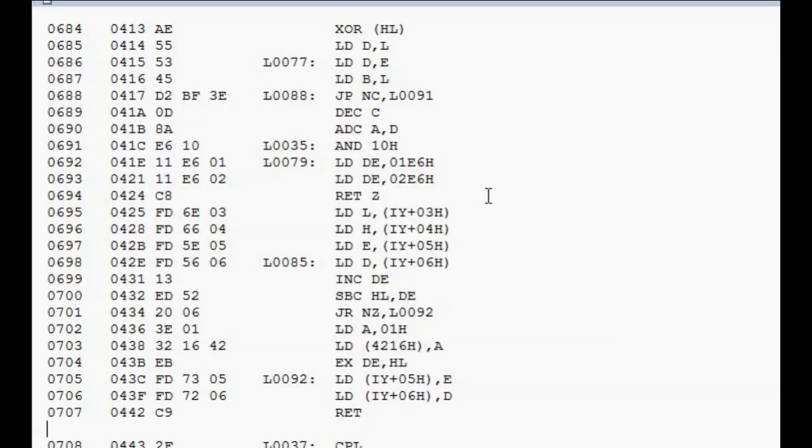It basically divides the addresses by 2. So for example, the 64K user RAM, that's the DRAM, on the CPU board actually starts at 8000 hex as far as the CPU is concerned, and then it's in 2-byte chunks. So from 8000 to FFFF is the entire 64K RAM block with an extra line to determine whether it's the high or low byte within each word. And then everything below 8000 is where the rest of the hardware was mapped. So that includes the scratch RAM, the ROM, the trace memory, all the in-out for things such as the serial. So all that was done in the lower 8000 hex memory addresses. So it's quite clever the way this system works.